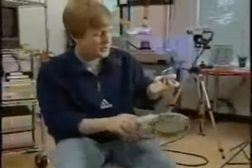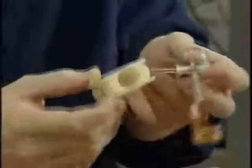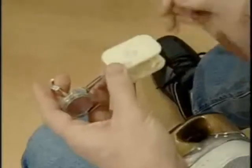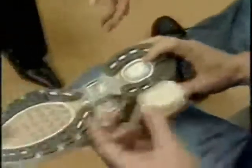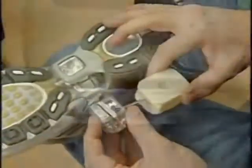This is the technology that makes that happen — built right into the shoe. Back here we have a cushioning element. We have our sensor, which is a hall sensor. The magnet sits underneath, located in that cavity. As this compresses, we can measure the distance between the sensor and the magnet. That information passes up into our microcontroller, which is the brain of the unit, and it understands the right amount of cushioning and can make decisions.